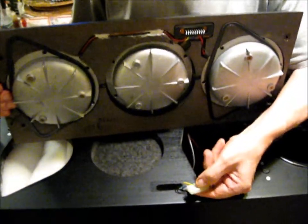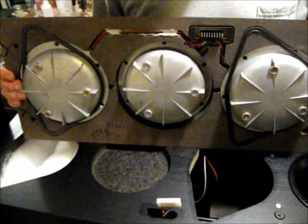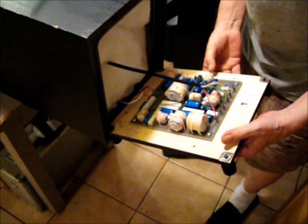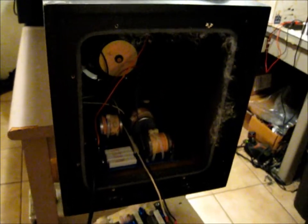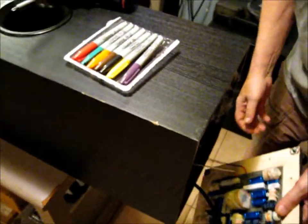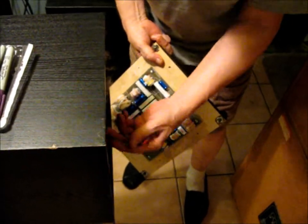This is self-explanatory and you can't really get it on wrong unless you try. When you put it all back together, clean these connectors with Deoxid or another high-quality cleaner. We've got more crossover components in here and then the bolt that holds the connecting rod for the woofers. These connections here, we don't have to mark these because they're labeled plus and minus — red plus, black minus.